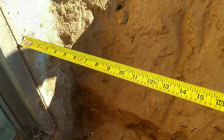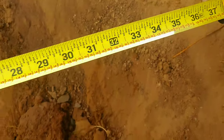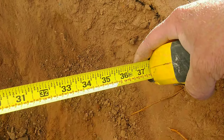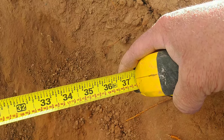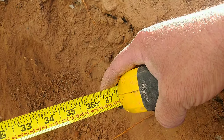From the face of this concrete basement wall we're gonna come out three feet — you can see we need to dig quite a bit. We actually need to dig past the three-foot line because that's where the wall is gonna start, the window well is gonna start. In this case we're gonna dig at least six inches past that so we can have a six-inch wall.